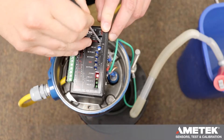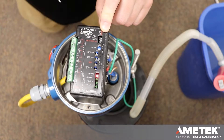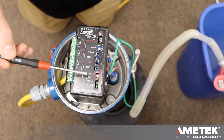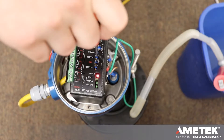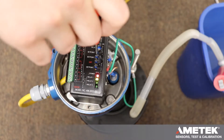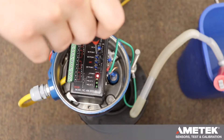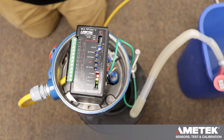Now we're going to turn differential cal off. For relay 1, we're going to turn clockwise until the LED is lit. Then slowly go counterclockwise until it goes off, and then back clockwise just until it comes on again, going very slowly.